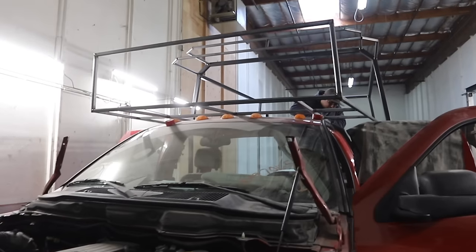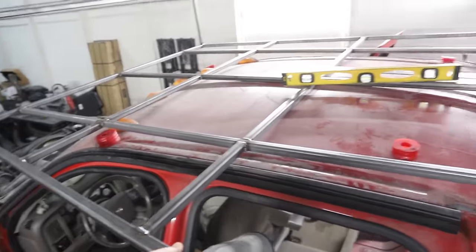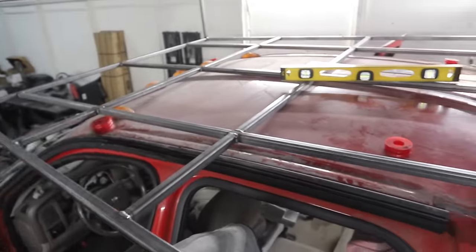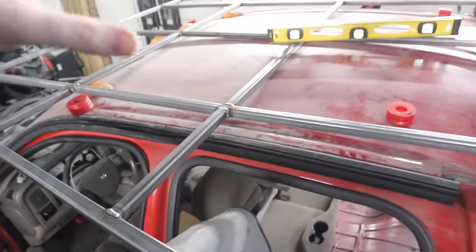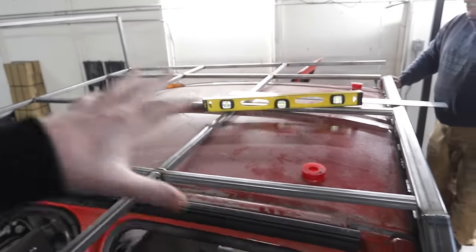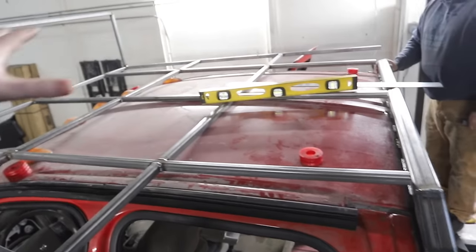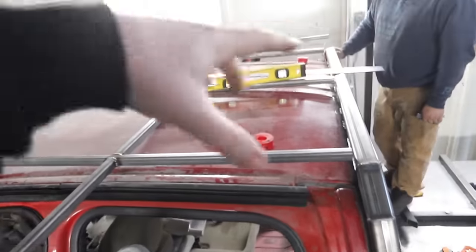Let's start working on our roof box. We've got this guy built out right here — this is where one of the beds goes and it kind of comes over the cab. We need to firmly attach it from here to up here so it can really hold its weight off of the roof. But before we can do that, we need to prep the roof and the bottom of this, because we're not going to be able to get access back into this when there's just a one-inch air gap after we weld everything in there.